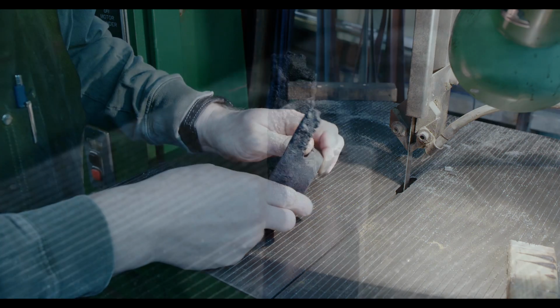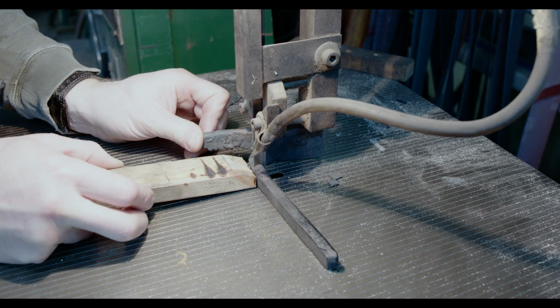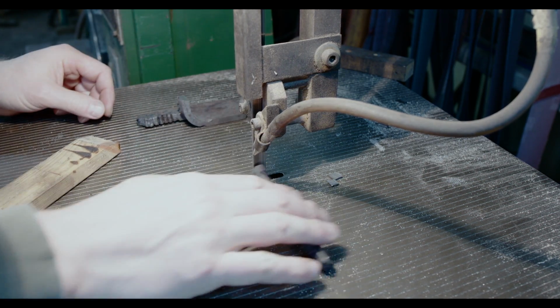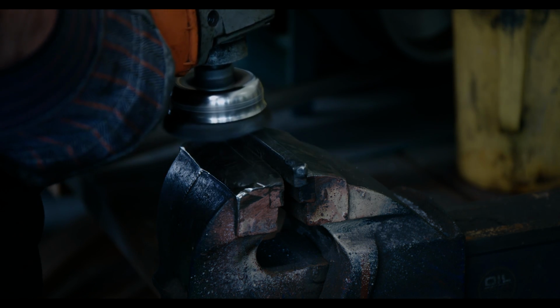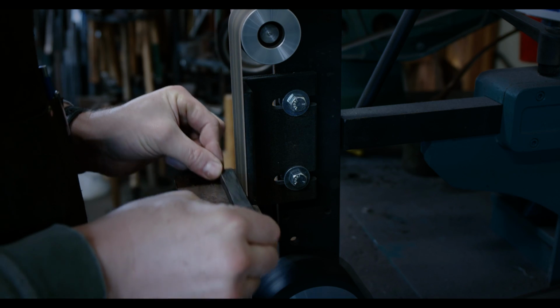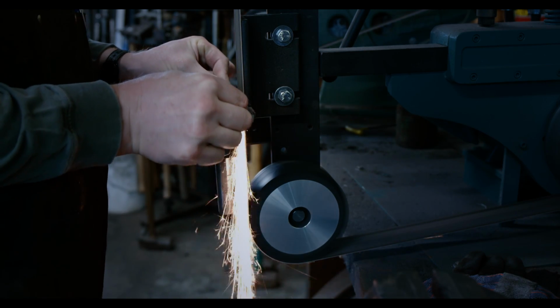The coal fire was quite hot, and in a moment of inattention I melted the high carbon steel and lost half of the spear. Since I was still interested in checking out the wolf's tooth pattern, I decided to turn the spear into a knife. I had a bar of partly twisted pattern-welded rod, as well as another bar of wrought iron. Forge welding these together with a half spear would make a beautiful looking knife.